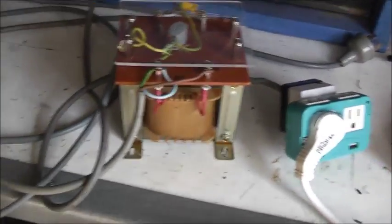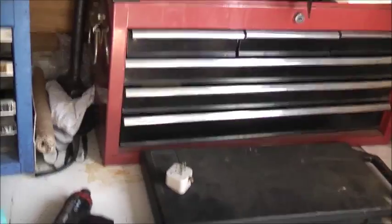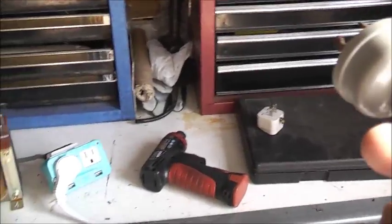I remember on a tram in Melbourne, there was all these American girls talking about having their hair dryers blow up. They come to Australia, they plug their hair dryer in with these little adapters, not checking the voltage setting on their hair dryer. If it's 110/240 volt compatible, fine, but in this case they're 110 volt only units. They're telling us all these stories about their hair dryers blowing up.